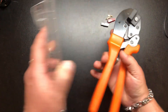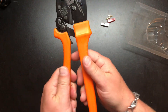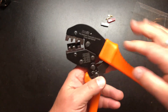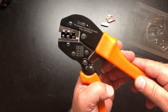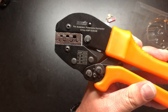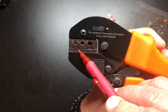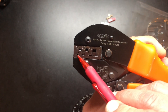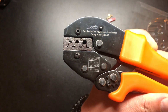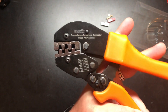Let's open her up and take a look. It's got a nice rubberized — like a hardened rubber — handle. Good jaws. One thing to look out for that I noticed on the last one I bought: when you clamp this down nice and tight, if you follow where the crimpers meet, there really shouldn't be a gap there — that should be pretty tight. That's something I noticed on one of the other ones I bought — it had a red handle, I can't remember the name, but it was pure garbage. Didn't crimp for anything.